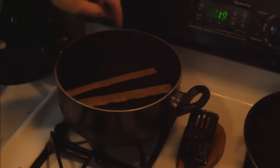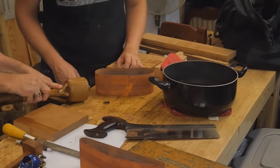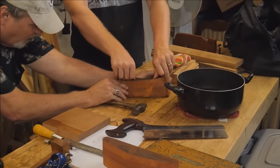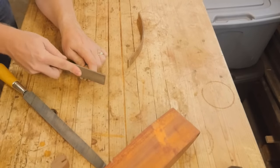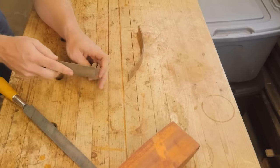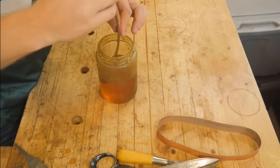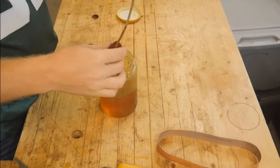To bend them and create the shape, we put them in a pot of boiling water for a few minutes, let the water absorb in, and then worked on them. We had to tap down one end because the water swelled it up a little so it wouldn't quite fit into the groove. Then we could bend it and let the sandpaper roll hold it in shape, let it sit overnight and dry out. I used a file to smooth out all the sides and give a bit of a roundover on the edges — left it fairly square shaped but smooth to the touch. I finished mine with boiled linseed oil, soaking it in about three or four coats, letting it soak in completely, then paste wax after everything was done.